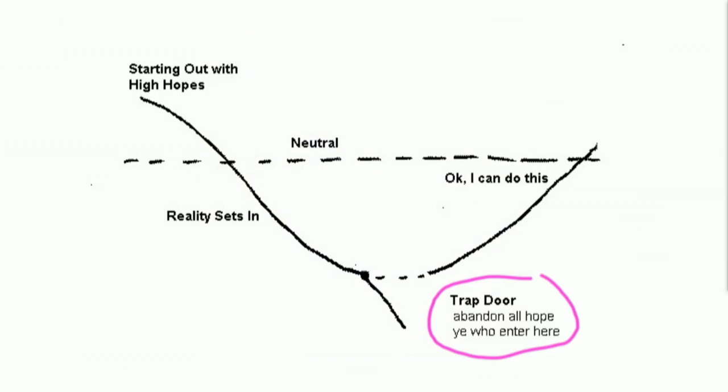So I think this is like my one funny slide because everybody can probably relate to this. I had so many gotchas. By the time I was about a year and 3 months or something, I had redesigned the power supply. I'd redesigned the motor drivers. My power layout pretty much sucked. Like, I used a star layout, but it wasn't working. And I was afraid to do too many ground pours or power pours because I was trying to save weight.